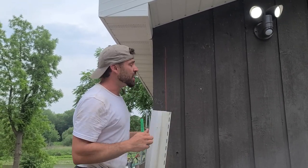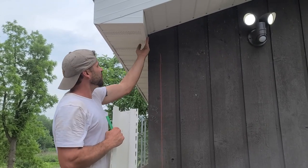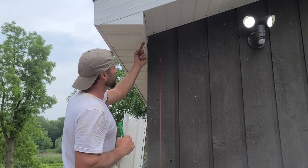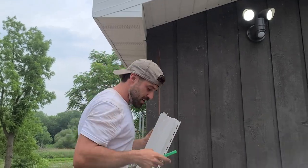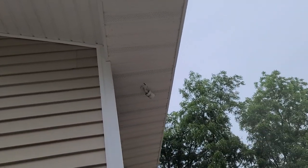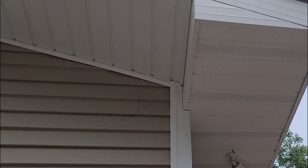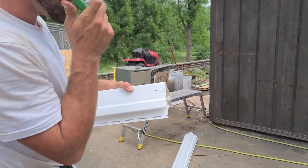And then the other thing you gotta be careful with is sometimes these bird boxes can get a little curved, if someone pulls too far in when they nail this on, or if it's sitting too far out because you didn't put a nail here. So this one's short, but if you look right here, come check out one of these. Like you can see on this one, I had to mimic the curve on it. It was much bigger, around 7 inches, and I had to put a little bit of a curve on that to make it sit correctly, okay?